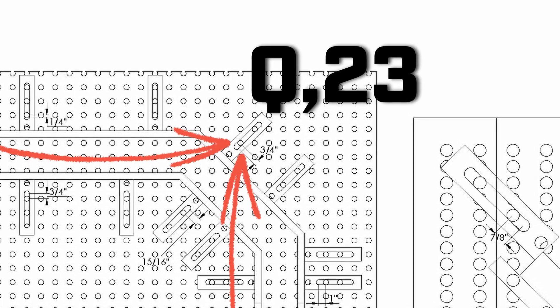I'm going to put this fence block in, which requires dropping the fence pin in the first hole and the third hole, just like that. Then I have a tooth block — exactly like we did on the table. Looking at the CAD, I can see what holes to put it in and how far it's extended: seven eighths of an inch, on the second row, third hole from the left, seventh hole up. I move it to seven eighths of an inch — boom. Then I repeat and put a block on the other side. I've got my 45 and my end stop.